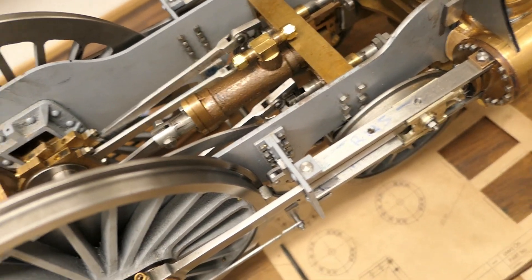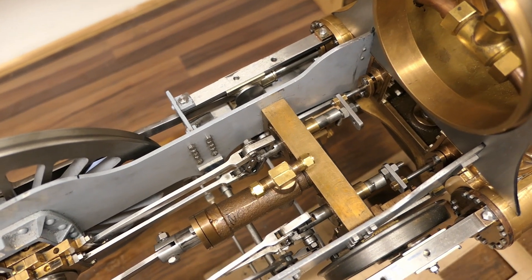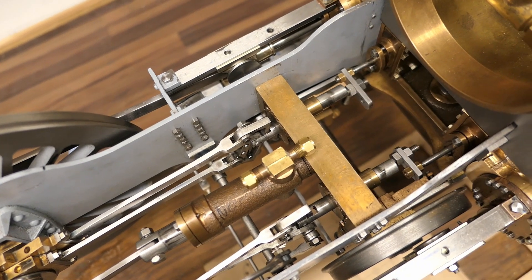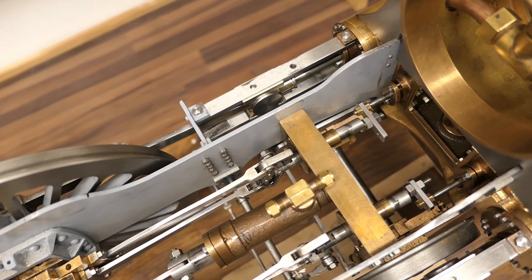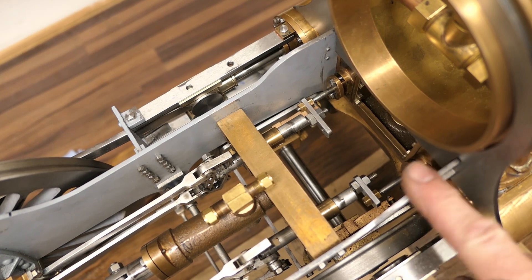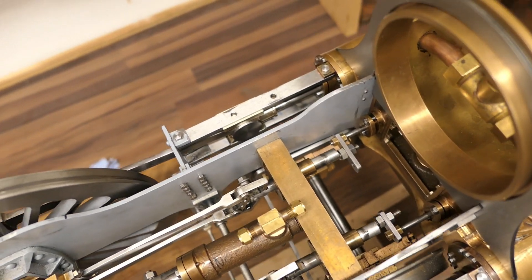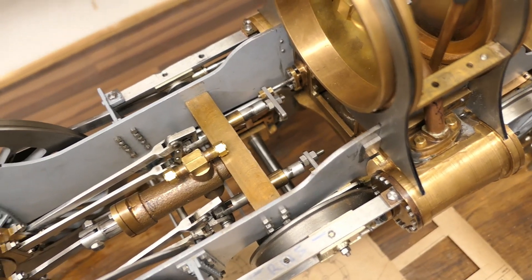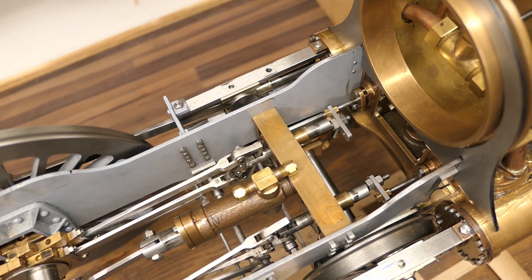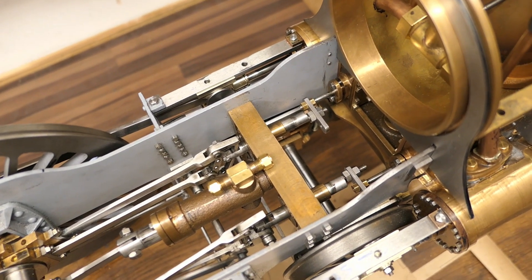If you are thinking of building a Stirling Single, the frames are actually bent — bent here and here — and everything has to be done pretty accurately. This bend is really important and it's quite tricky to achieve. I was fortunate: I drew them out and got the frames laser cut, and the people that did the laser cutting had a bender and they put the bend in for me. Cannot claim any credit for that.